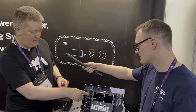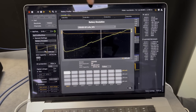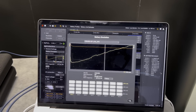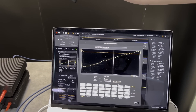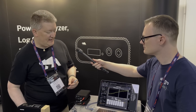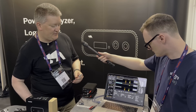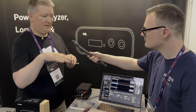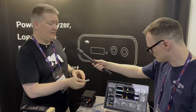This shows a coin cell with the open circuit voltage, internal resistance, and then you just choose where you want to be on this curve. You can either let it discharge, or you can say 'I want it to stay at a fixed point,' which you cannot do with a regular battery. In the profiler, you connect your battery, select your discharge current characteristics, and let it run until the battery is empty — then you have this battery graph instantly.